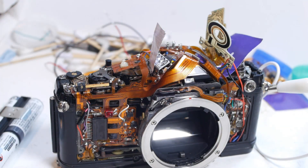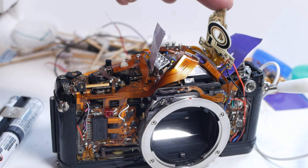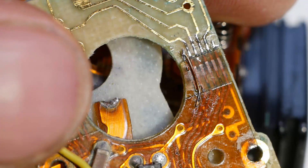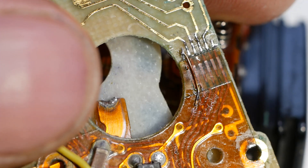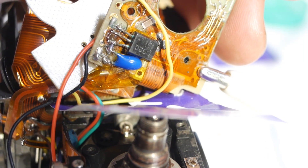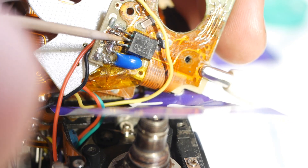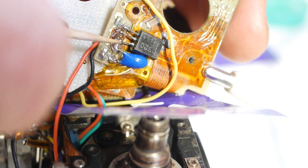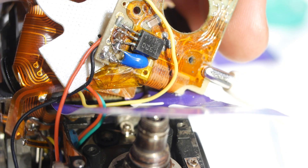It's now a couple of days later and I didn't find any more broken tracks, but I did find that most times I turned the camera on it was dumping all the voltage out of the batteries, so clearly there was a short somewhere. I suspected the shutter speed board, partly because that was the one I moved earlier when the camera started working, and also because you just can't see the tracks — the flexible PCB being sandwiched onto the rigid PCB at that point creates a four-layer board to contend with. After much scrabbling and prodding I did find a fair bit of corrosion between the two boards, which I've cleaned off as best as I can. I also rerouted another suspect track, but the camera still won't work. It seems to be more flaky than a flaky thing.